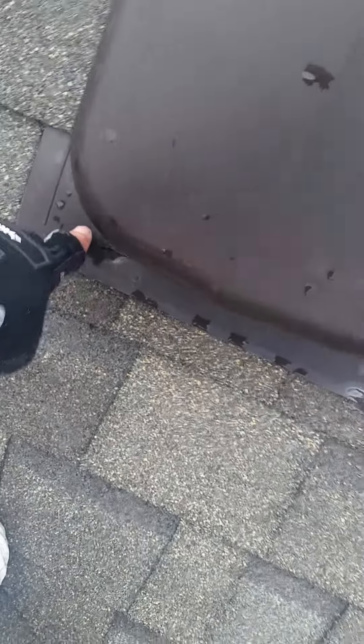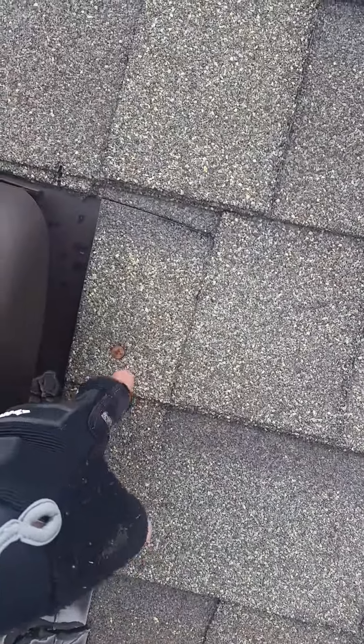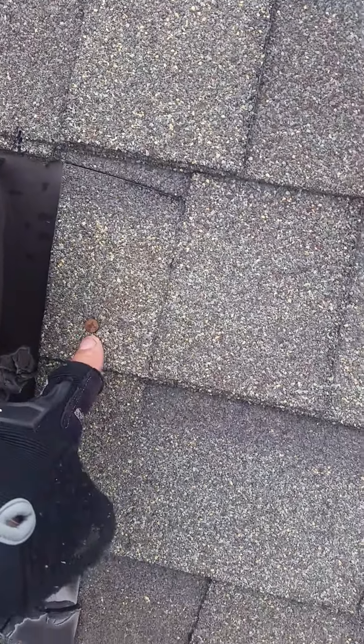These PRV-50s come with pre-drilled holes, and these nails — if you don't hit the holes, they crack. Under here is a pre-drilled hole. They nailed it right on top of the shingle, and it cracked. These are leaking.